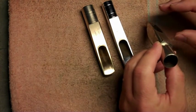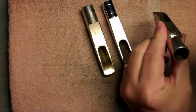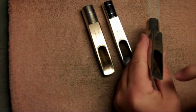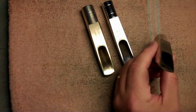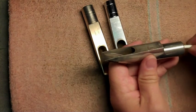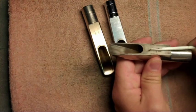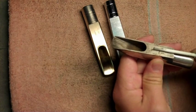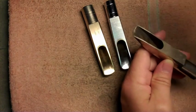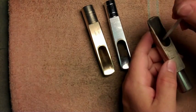The throat is kind of like a clarinet throat — straight sidewalls, or a little V-ed going into a round counterbore. The baffle extends all the way — I'm going to go in from the bore until I feel the baffle sidewalls. The baffle extends to about here going into the chamber, sloping in. Now, that's difficult to machine that way. You can cast these blanks, but I believe they probably machined part of this baffle.